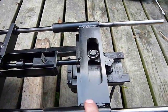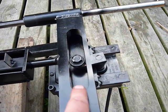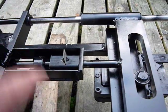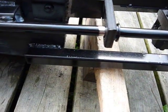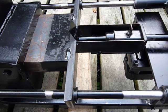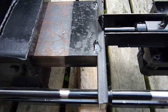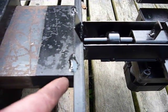This piece here is a one and three-quarter by five-eighth solid bar — I milled the slot in it. These bars here are half-inch, as is that one there. The frame for the motor is twenty-five mil heavy-wall high-tensile box section. It's just stuff I've put away to do this as I've gone along. The block there is two pieces of five-eighth plate that are welded together at the rear and at the front, welded in behind this. Then I machined it off square so that we've got a nice square pusher block, which is an inch and a quarter high.